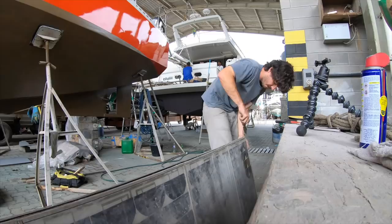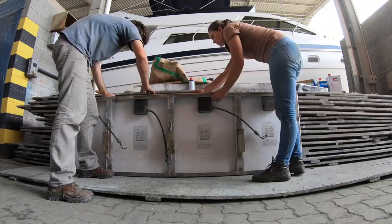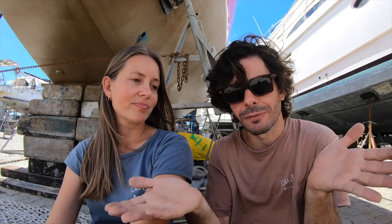But when we took off our old ones, we noticed that the aluminum frame was corroded. It's amazing how 22 years corrode aluminum in touch with stainless steel, because, you know, electrolysis, and the frame was destroyed. I mean, even though the solar panels still work, the frame is just destroyed. So the idea is not to use them, because nowadays the efficiency of solar panels is really good. Yeah, so basically the old one produces half of the energy with the same area compared to new ones.